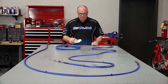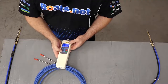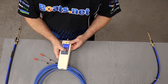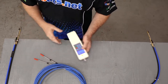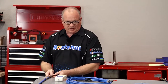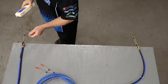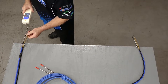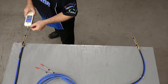So what we're going to do is take a force meter and take a look at each cable side-by-side, taking a force measurement in foot-pounds and looking for the peak. It really wouldn't matter what unit — we're just looking for a comparison, because in each scenario we have both the Multiflex cable and the standard cable. We're going to pull both of them all the way out at a consistent rate and see what they measure, stopping a little bit short so it doesn't bottom out.